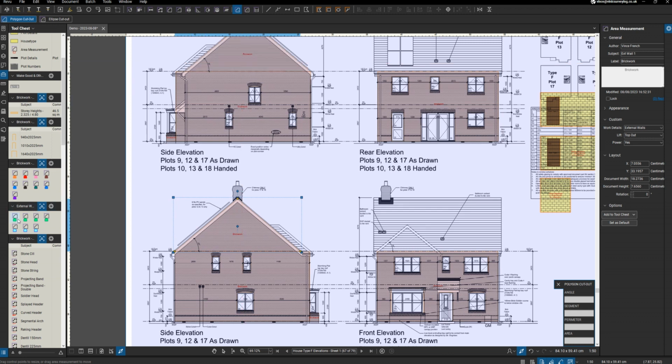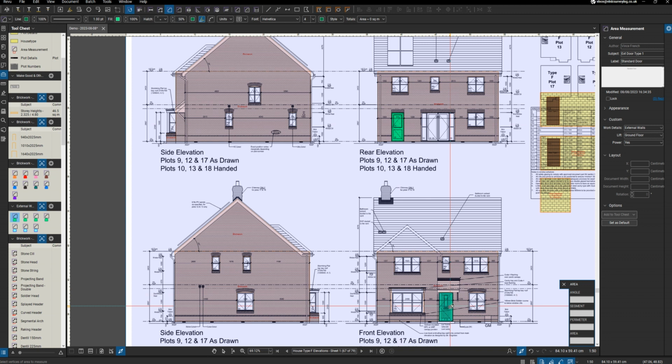So over here, I've got some details for filling these openings. External door type 1. Now I use that for these doors, personnel doors, whereby you might have returned reveals, blockwork reveals, thermobate or something like that. Have a door type 2, which is likely to be formed with a window former. Then we jump over here, we've got window type 1. Now I'm assuming this is where we have a standard lintel above and cavity tray. That one, this one, and these ones.